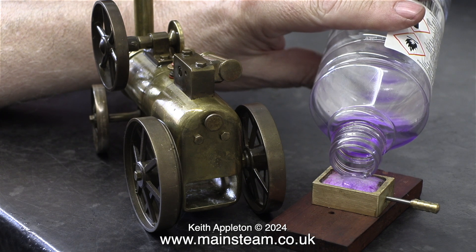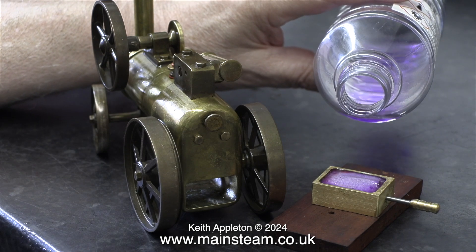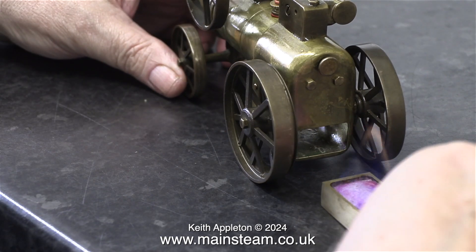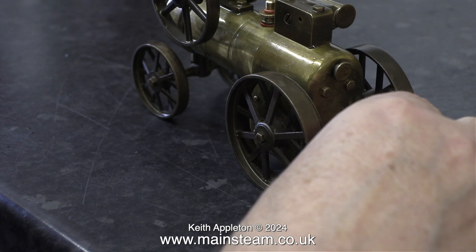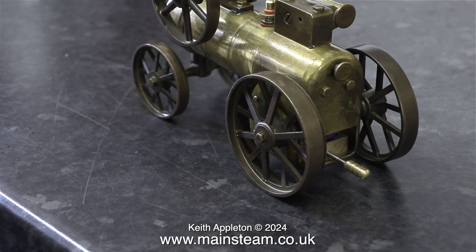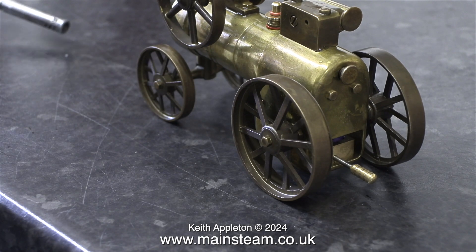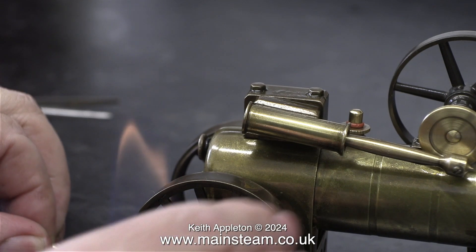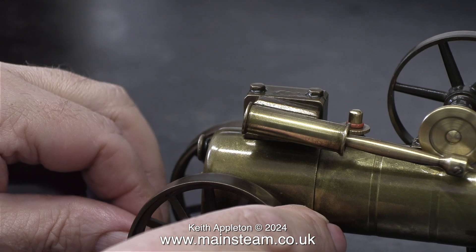After a while, I blew out the flame and refilled it right to the top. Now I'm going to try it in the engine. I have one minor criticism of this model which has a bearing on this steam test: the water level filler plug is a bit too high in the boiler, and for the size of this very small burner and small surface area of the firebox, the boiler's water capacity is far too great. I'm checking that the burner's lit — and it is — when I slightly squeeze the trigger of the gas lighter, but not enough to make it spark, the gas is ignited by the methylated spirit. This is quite a healthy flame now from the burner, far better than the gel stuff.